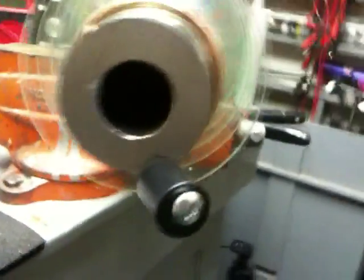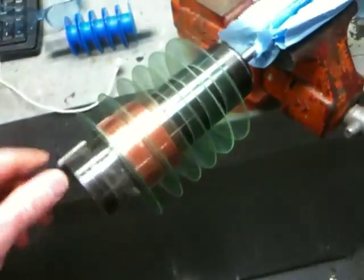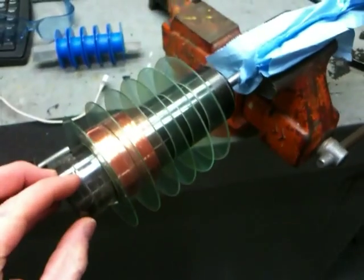I've got this on my big core, and then I've got this little bearing I made — a little bushing that just sits in there — and I can basically hand wind this. That's what I've been doing, I've been hand winding these coils. I'm going to do the rest of them here. There's five of them on this, and this is with a steel core.